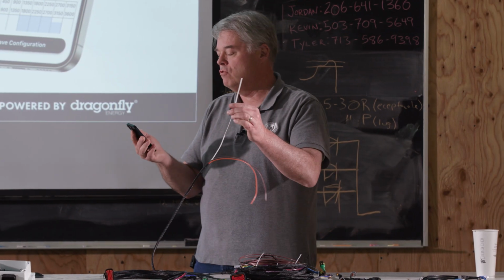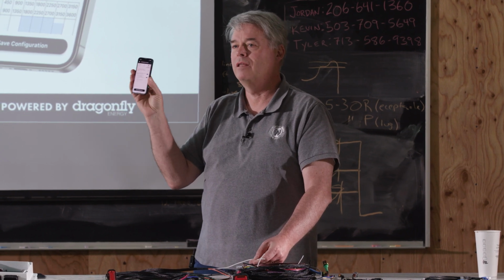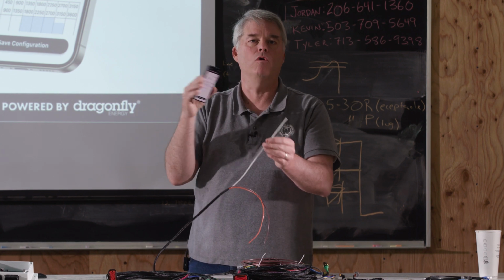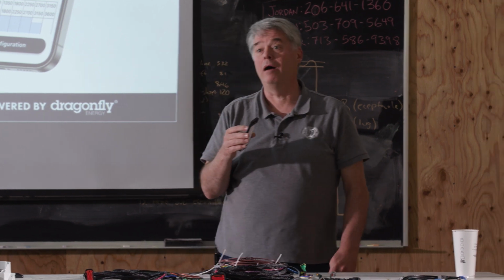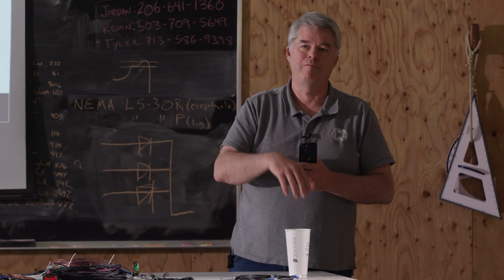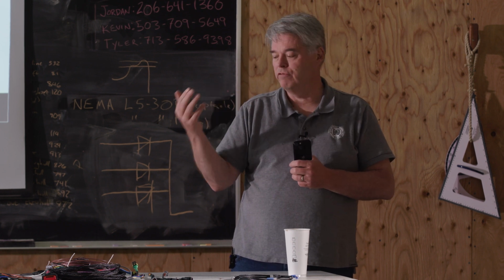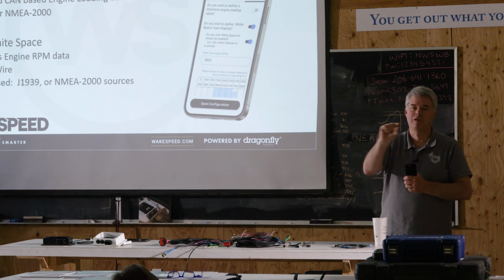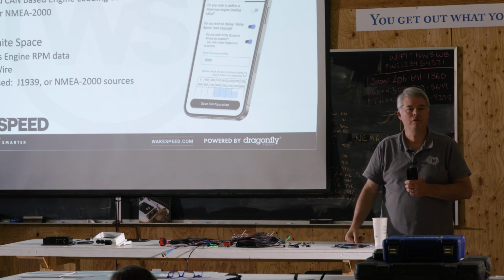So if you want it to be always enabled, turn that on. If you want it only when the feature in wire is active and white space will be overlaid, you can do that. This is useful in a scenario where you've got a hydraulic pump that's also on that engine, and a way to signal to the regulator that it needs to reduce stuff back. Of course, another way you might address that is to have the feature in wire select half power mode and declare a percentage value of like 40% for the alternator at half power mode.